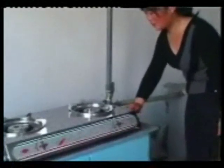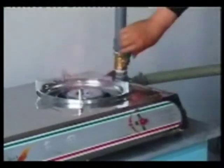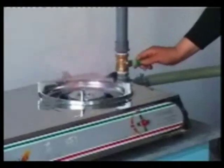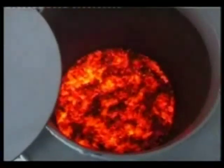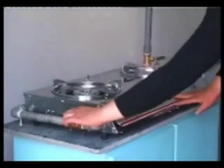Press the electric igniter pulse switch, then open the gas valve for the chosen burner. Once the stove is lit, close the valve of the vent pipe. The stove takes between 8 and 12 minutes to boil 1 gallon of water, which is comparable to natural gas. The caloric value of the gas is between 4,600 and 5,200 kilojoules per cubic meter. Once 50% of the biomass materials are consumed, it is important to refill the reactor until it is completely full. Each burner has an independent valve to control the height of the flame, located on each side of the stove.